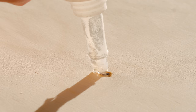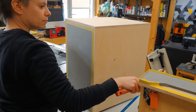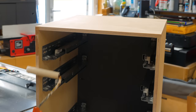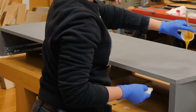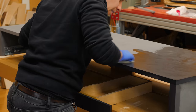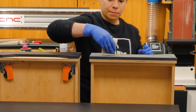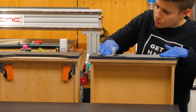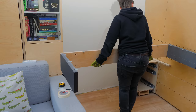The project is complete — now I can move into sanding and finishing. I spot-treated tiny knots with CA glue and activator to level the surface. I wanted the best of both worlds: a deep grey almost-black MDF as well as light-colored birch plywood to match the rest of the apartment. So I masked the areas I didn't want to hit with the oil-based finish. I first applied water-based varnish to all the plywood faces and edges. After two layers of varnish with sanding in between, I removed the tape and spread the hard wax oil finish. If you apply the water-based varnish first, it will restrain the oil finish to the naked areas — doing it the other way around might not work because oils tend to spread to unwanted areas even below masking tape.